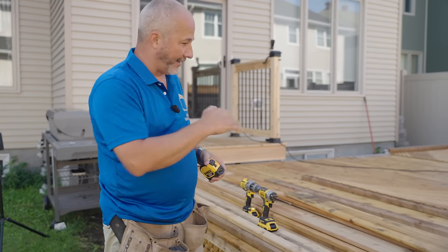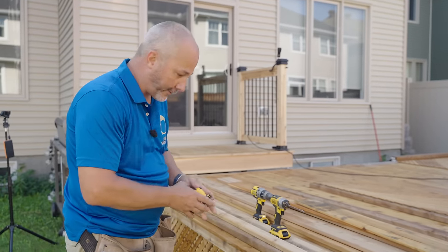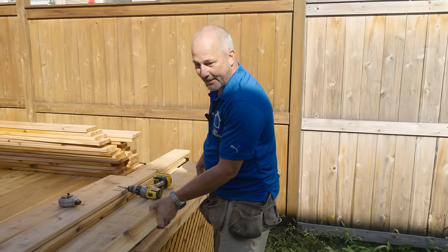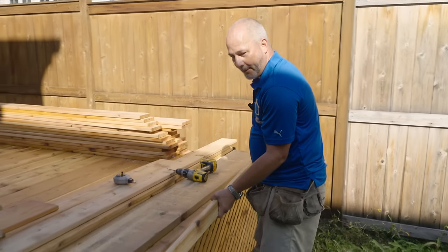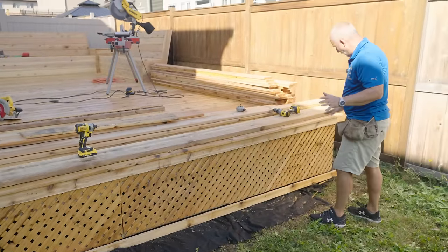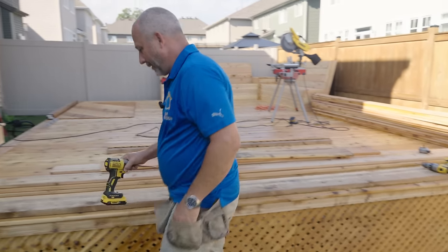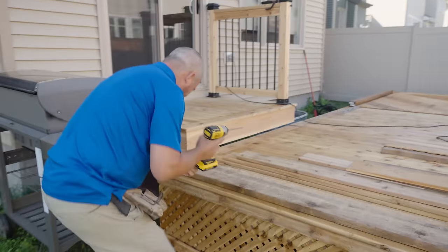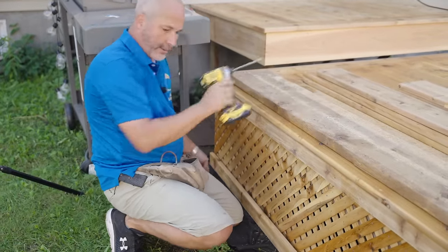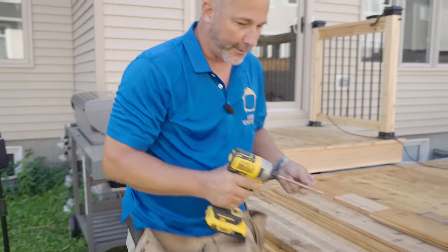So now do the same thing with that lattice from the other side, okay? We'll cut from a straight line again and then measure down to our three locations. Now here's the secret sauce, right? We put the other half of that down. And it's not designed to close the gap completely. It's designed to get close, okay? So here, same thing. This one's a lot closer to the actual location, so I'm going to let that be my extra pair of hands. And I'm going to start over here and lift it off the ground.